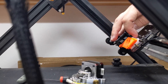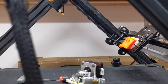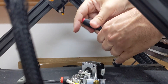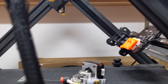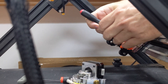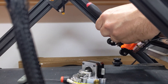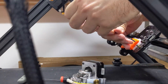One thing with this — it's a very quick design — you do have to put in the CR30 screws first, or it won't actually reach. These screws are covered up. All these have nut traps in the back, so it's going to be a real pain to get the nuts in for this one, but the rest of them should be pretty easy. Use the screw to get the nut stuck in its trap, I should say. The rest of these should be pretty straightforward.